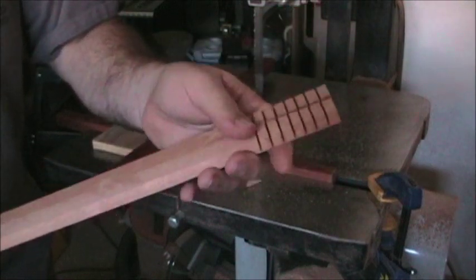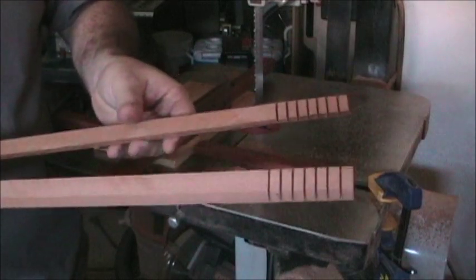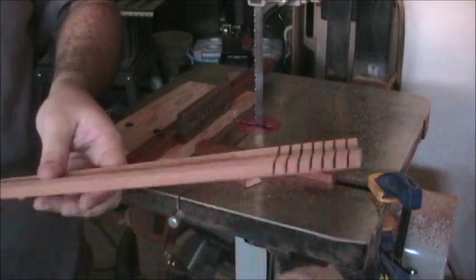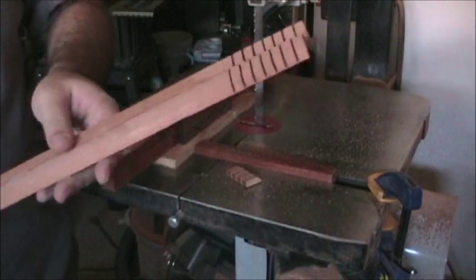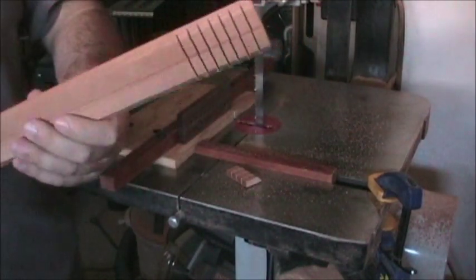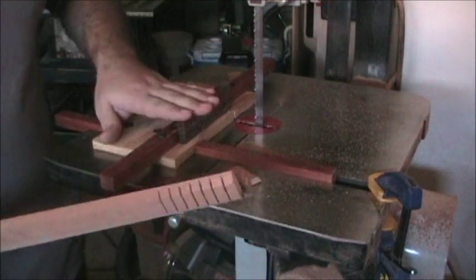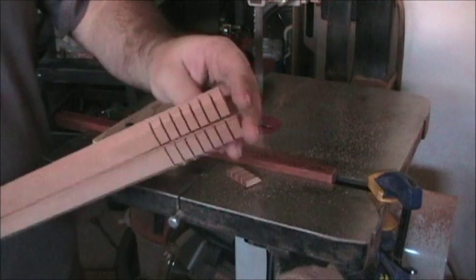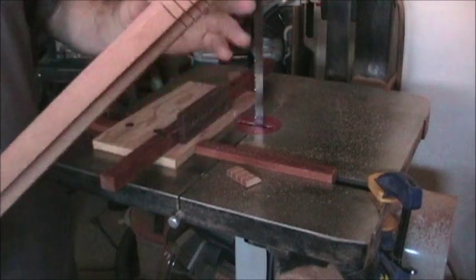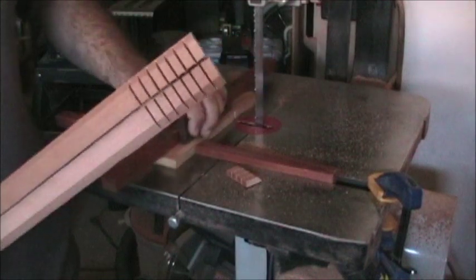As long as you take your time with it and move it to the mark and go real nice and slow, it'll be nice and even kerfing. You can make this stuff in any size. These blanks are a little bit taller than I normally use — I run them through and take a little bit off of them again. I have a little different strategy for making blanks now, and that's covered in the article section of the website, www.SixGunGuitars.com. There are also instructions for this jig in the article section on the website as well. So between the video, the article, and some of the pictures on there, I think it'll be pretty easy for you to set up a nice little kerfing jig where right in the shop you can make all your own kerfing out of any material you want — I normally make it out of mahogany.